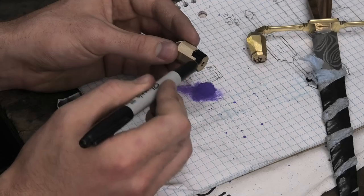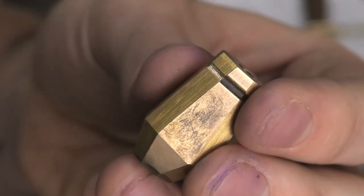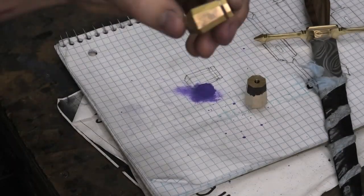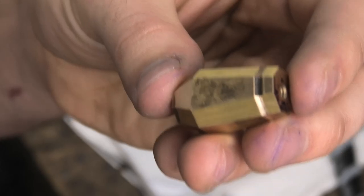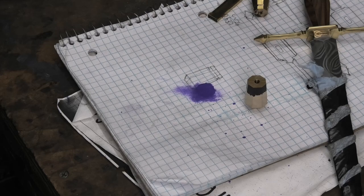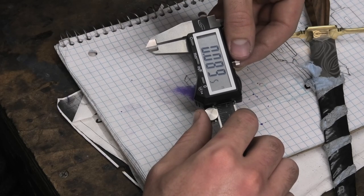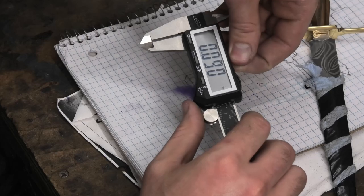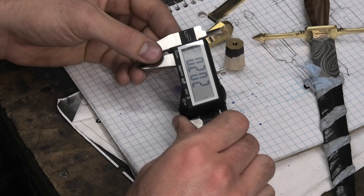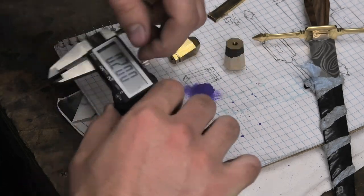One of the things I'm doing to make this more interesting is this groove on the bottom. You can see with that finish you get that blackness that you can't clean off — that adds a lot of texture. I think this finish is so cool, especially with little grooves that naturally stay dark and dirty. It looks realistic and old, but in a good way. That groove starts 90 thousandths from the base — I'll go 100 thousandths. The end of the groove is going to be 190 thousandths.